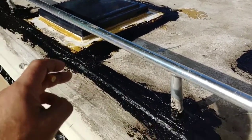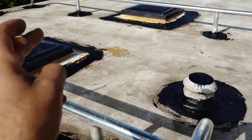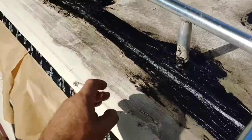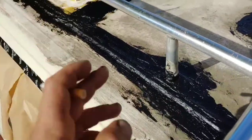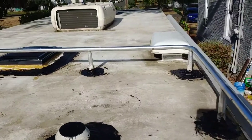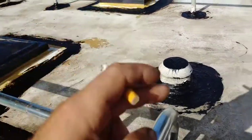And a lot of this, I'm gonna call it snow coat or caulking that was on here, was all cracked up around everywhere. And you can see that somebody's done some sort of coating, but the stuff was coming off. So I chipped off all that was loose and went over it with leak stopper roofing tar. And of course I made my own flashing around that with some rubber membrane that I had laying around.